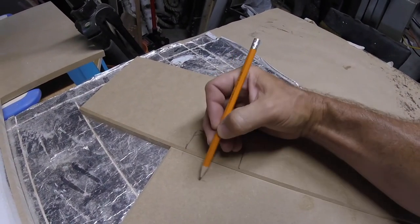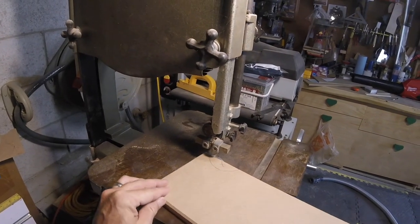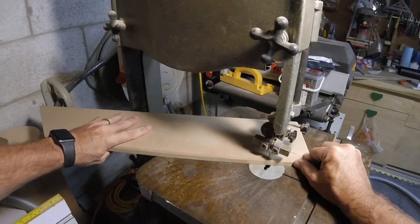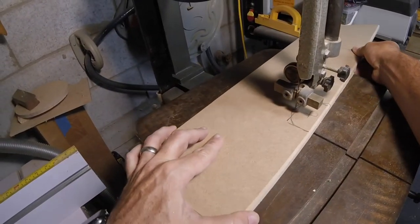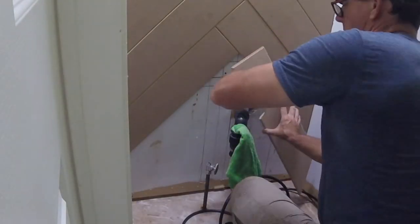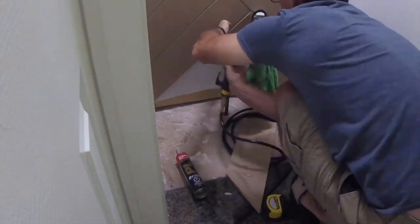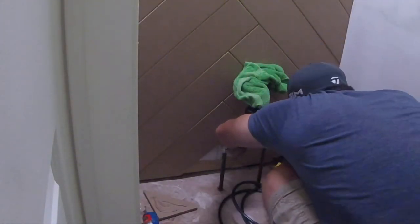Working around some obstacles: going down from my first piece I was going to encounter the drain pipe for the sink. I just laid the first piece on top and generally marked out where it was. It is going to be behind the vanity so it absolutely doesn't have to be perfect, but do as well as you can. If you happen to have a band saw, terrific, but this can easily be cut out with a jigsaw. Add the adhesive and it just snugly sits right on top of that pipe. If you have all your pieces ready to go, they all just go in lickety-split — this really did go pretty quickly once you're going.